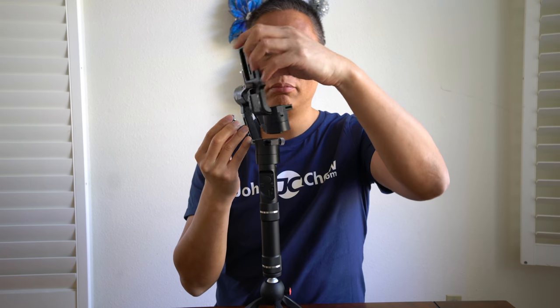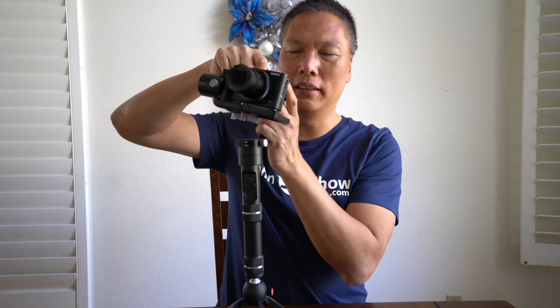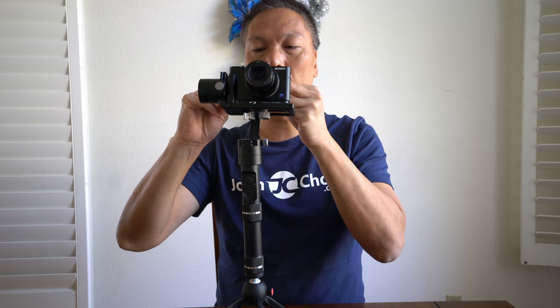Okay, this side — there you go, that's it. You screw that in there. Now I can mount it right close to the motor on the correct side and screw it down like so. Now it's right next to the motor, and because it's not all the way out, I can now balance it. Let me turn it on. It's a little heavy here, so I'll balance it by moving this a little bit. Okay, now it's balanced — just one millimeter more. All right, now it's balanced.